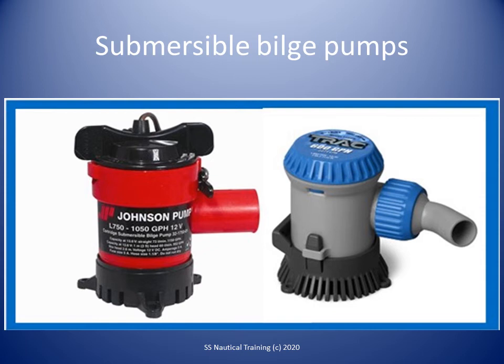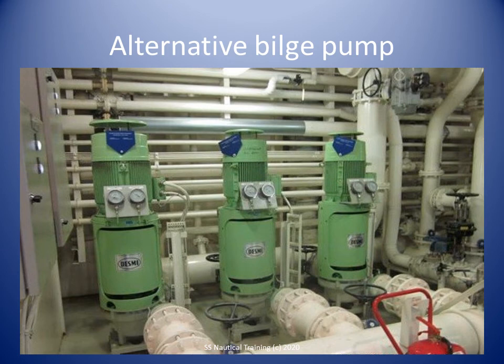The flexible hose should be suitable for the intended use, including highly resistant to salt water, petroleum oil, heat, and vibration, and located to minimize the risk of accidental damage. A power-driven fire pump may serve as one of the 2 fixed power bilge pumps on vessels of 20 meters in length, if it has the minimum flow rate required by the regulations.